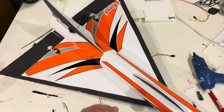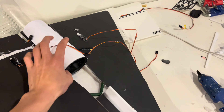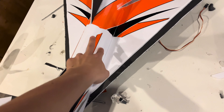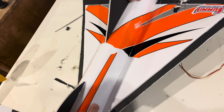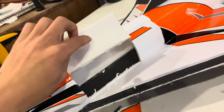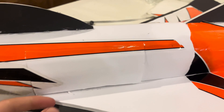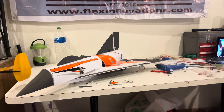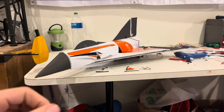Now that all your servos are installed, the next thing is to find a place to wire them all up in your main fuselage. We also need to make a hatch, which is probably my least favorite part — you need to cut it right off the side. The best way is to cut a little hatch right here, right over the sticker so you don't need tape. Here's your hatch — all your electronics will go in here. For how to set up all your wires, I recommend going to another YouTube video. But that's the end of this video — thanks for watching. I upload every single Saturday at 9am. See you guys in the next video on RC Shenanigans.